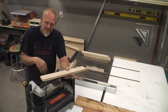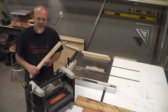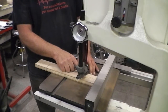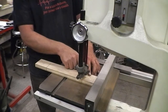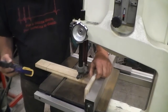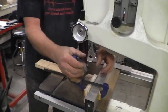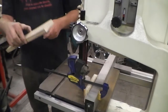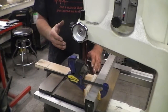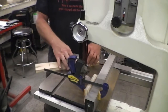I'm going to cut these down to 11/16 and put them in. I've purposely taken the tables off — there's no infeed, no outfeed table. I'm going to put these on there, run these boards through, and show you there will be no snipe. To answer how I make them: I mark to 11/16, stop and shut the saw off, then come over to my fence, raise the block up just a little so dust can get underneath it, clamp it down, flip the piece over, and the fence is set to the proper distance.